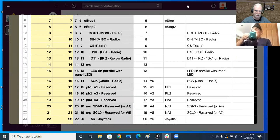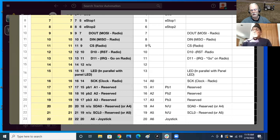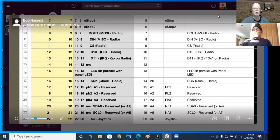The chart I was making is what I was going to do for my new one. I see what I have here is not going to work right out of the box because this chart says for the radio it needs MOSI, MISO, and chip select, and I've got those on pins 7, 8, and 9 — but that turns out to be the secondary SPI port. The link I posted at the last meeting confirms you want to use the standard SPI port — pins 11, 12, and 13 instead of 7, 8, and 9.